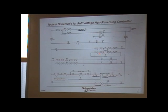And that's when you go to all these points and find out, okay, do I have continuity from here to here, like my connection wise, here to there? Right here, did this close? Did this auxiliary contact actually close, or is it made or not? That's going to provide that power to it.